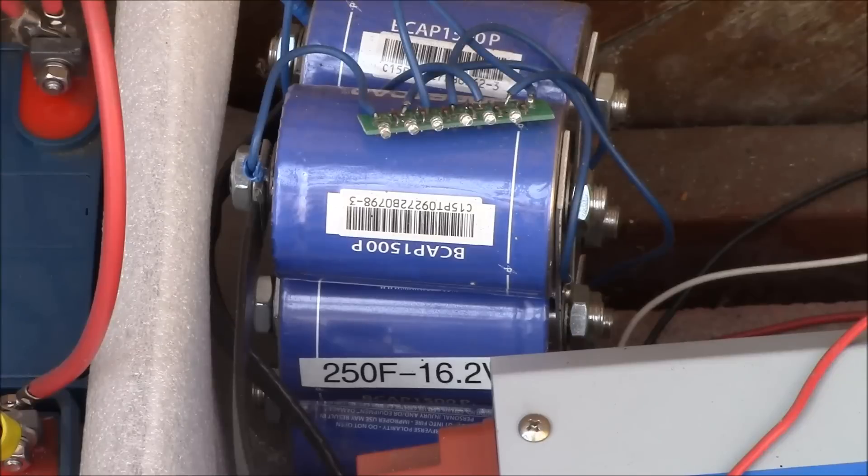One time I saw 168 amps. With 4 or 5 parallel batteries, that's about 35 to 40 amps per battery. Considering these are 35 amp-hour batteries, that is about a 1C current. I increased the wire gauge and did some other things to help the inverter with this load, then hooked up the capacitor bank and ran some additional tests.